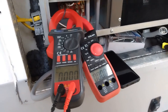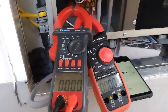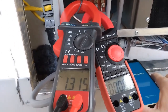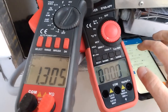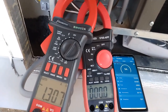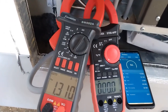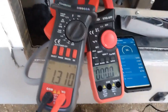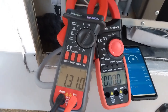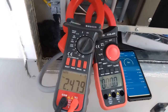Alright, hang on. Alright, so now we're on the GoPower 3000. So let's see what happens. Pull up the shunt. So 236 watts out, 280 watts out. All we have on right now in the house is a TV, maybe a small fan, refrigerator, which is a separate inverter with the same batteries, and now the air conditioning. So let's see if she trips, because it used to trip right after it started. Five amps. Pulling almost 700 watts out, 600.